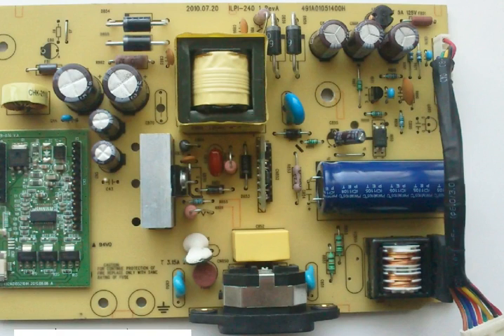Here's a quick tour of your power supply. The first thing to do before you do anything with any power supply when you take it out is discharge this capacitor. If you google 'discharge capacitor' you'll find a number of ways. The way I do it is I have a bulb with two wires on it — put it across the capacitor and then check with a meter to make sure it has been discharged.